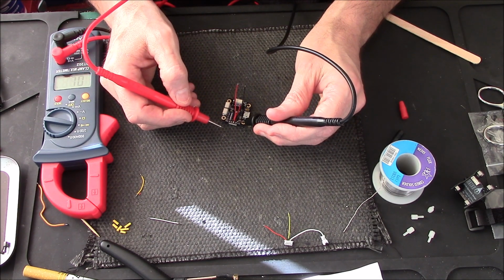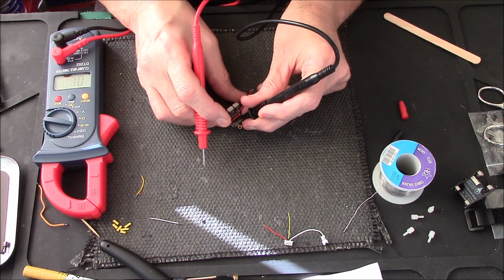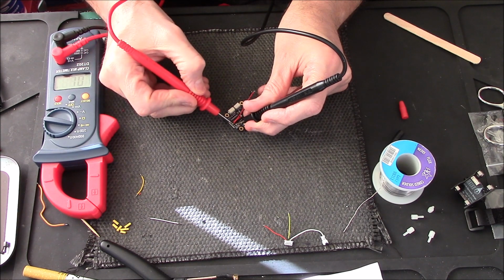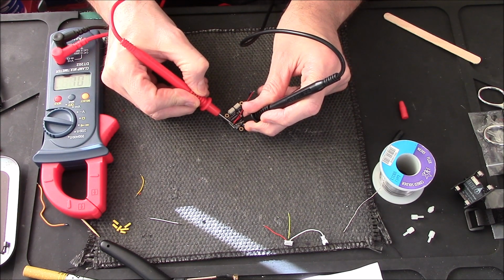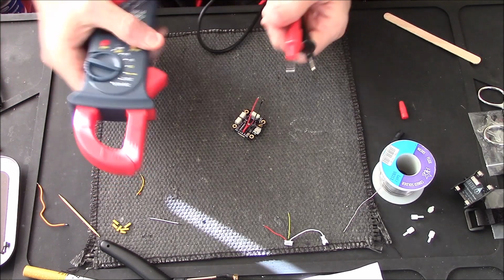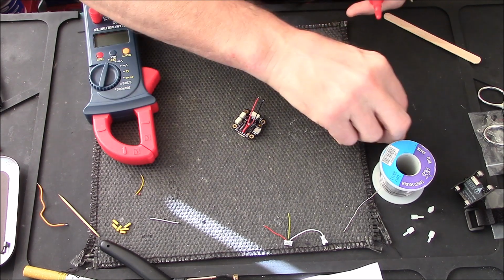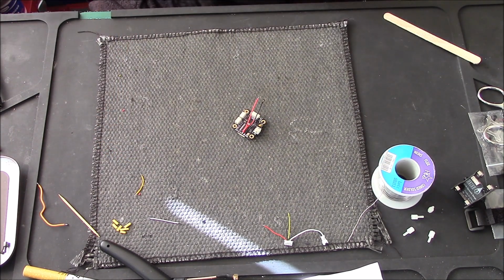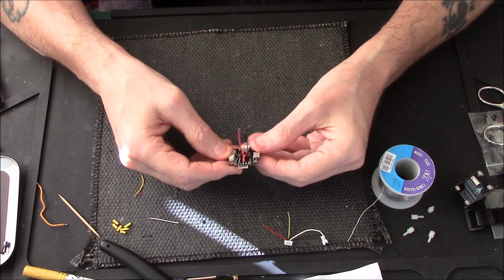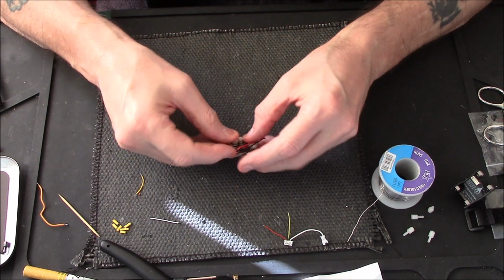And I made a mess of it. The awkward thing is it's so small and fiddly and I don't want it to wobble about. That's on the black. That's on the red. Absolutely nothing. No beeps at all. So we know now they're not touching, so we won't have any damage. So we're good to go. Now if there had been a beep, I'd have had to unsolder and start again. But you must get yourself a multimeter, because without one I wouldn't have known, and if I'd plugged this in and they'd touched, you'd have gone puff, magic smoke, and I'd have been sorry.